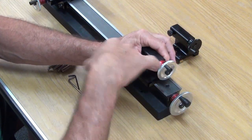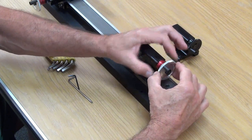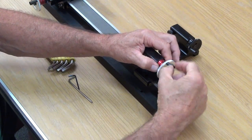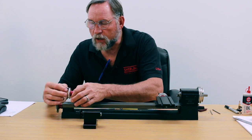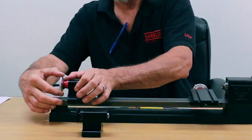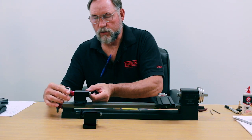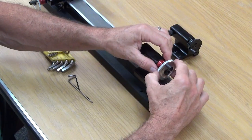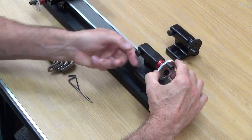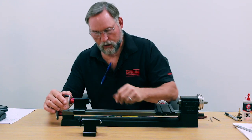Your collar has an access hole in the side and you have to line that up with the set screw hole that's in the hand wheel. The set screw hole is almost always in the same area as your hand wheel knob. So if you put your hand wheel knob up and turn the collar, you'll see it's now lined up with the set screw inside. Unlock your spindle, turn it so that your hole and your access hole are straight up and down, then lock your spindle lock in place.